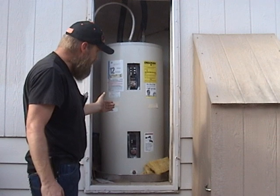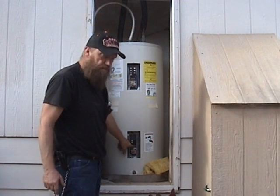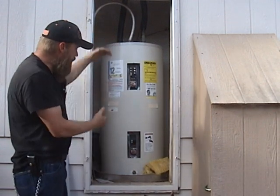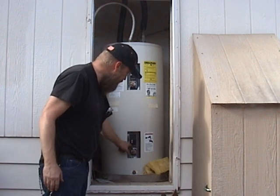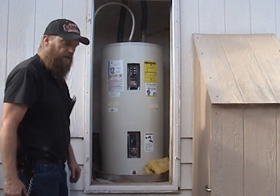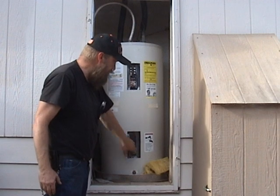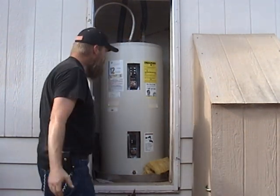What I tell people to do is give it a shot — turn this lower temperature down to minimum and see how you do. If you've got enough hot water, leave it that way. Or even better yet, make sure your power is off first, then disconnect one of the wires to the water heating element on the bottom. That way you can be sure this thermostat will never activate, and you'll just heat up in the upper section.